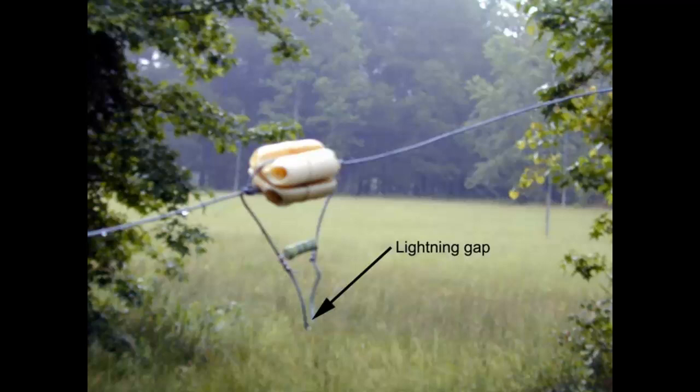You can solder them right to the pigtail of the beverage like this, as long as you use that solder wrap method that I showed earlier for the flying connections, like would come down to the beverage transformer itself. As long as you heat the resistor lead and the solder and don't get the galvanized area too hot, hot enough to flow, but not so hot that you start to burn the galvanizing off, then you can have a joint that'll hold up a long time with regular solder. It'll hold up a long, long time, many years outdoors, and not deteriorate, and you really won't have any rust forming around the joint if you do it all correctly.